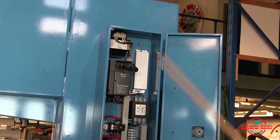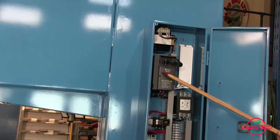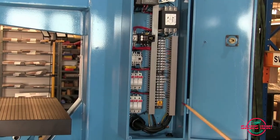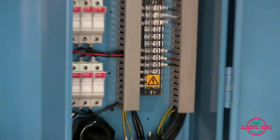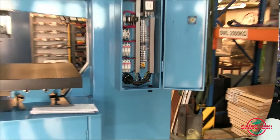Just to show you how nicely laid out the control panel is: you've got a transformer here, the frequency inverter for the blade speeds, the contactors, and the fuses. If you're connecting the machine up, it's to L1, L2 and L3 at the bottom here, with the earth connection there and your feed for your cable in the bottom. That will help your electrician — if he looks at this video he'll know where to connect.